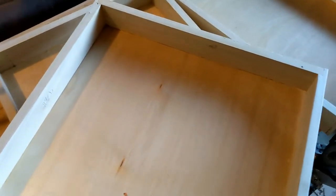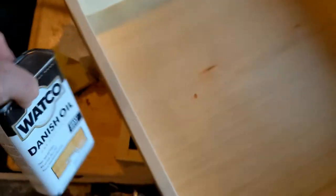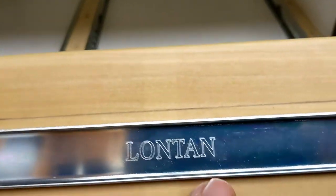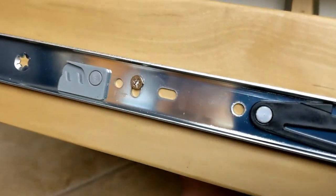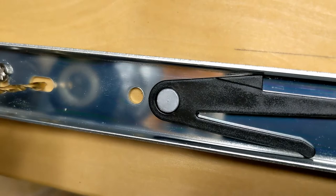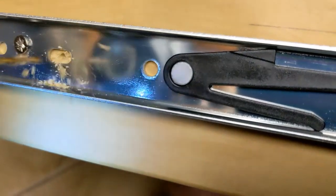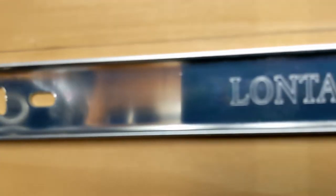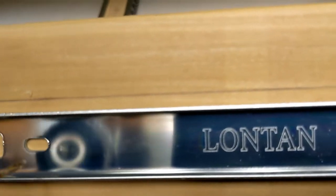You can see all that glue cleaned up really nicely. I'm going to sand it with 100 and then 140 grit and make sure the edges are rounded. Here we have the track being screwed on. You can see that I just have two screws and I put them in the holes that go up and down. This is for the back and for the hidden corner, so I wanted to try it first. Once I'm happy with it, I'm going to put two screws in each set of holes, and that will make it nice and secure.